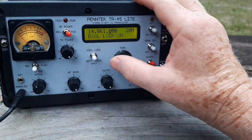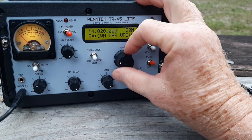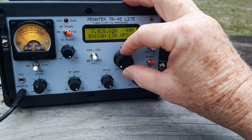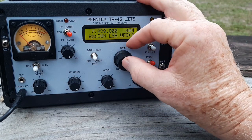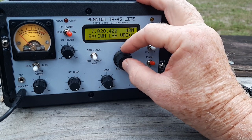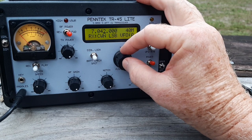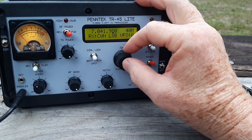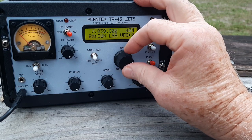With whom I can demonstrate the notch filter. Let me tune around a bit — there's nothing on 20. I can't transmit with this antenna on 40, but let's just take a listen. I'll show you a little about the tuning. I'm in the 100 Hz digit right now. A quick press puts me in the 10 Hz digit; another quick press puts me back in the 100. A long press gets me to the kilohertz, and another long press gets me to the single hertz digit. The most common are the 10 and the 100 — I can get around the band quickly with the 100 and easily tune to stations in the 10. That's why they're programmed to be short presses.